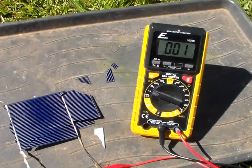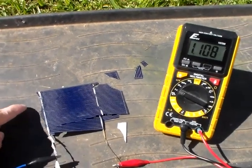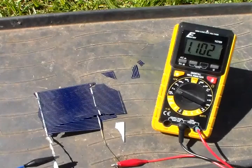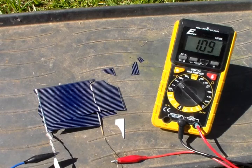Yeah guys, you saw it was still producing power even when it was cracked. The full panel produces about half a volt, or 0.50 of a volt. So even with this part here broken off and this side here broken off, it was still producing half a volt, which is pretty amazing. Actually right now it's producing one volt, which is pretty cool. Anyways guys, that's just a little video talking about whether you can use cracked solar cells to produce power to make a solar panel. Got any questions? Feel free to leave them in the comments section. Thank you all for watching.